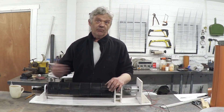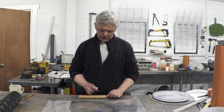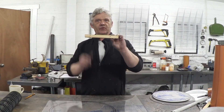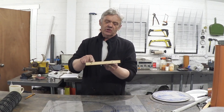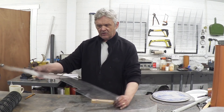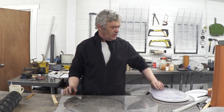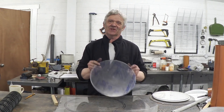That should also strengthen up those bearings. We need a top disc and a bottom disc. To cut large discs, grab a bit of wood, drill a couple of holes in it and put in a couple of nails spaced apart at the radius of the disc — the circle you cut will be twice that distance. Sharpen one nail up with a file to a nice sharp point, drill a hole in your acrylic, press on that and go round and round to score out your disc.